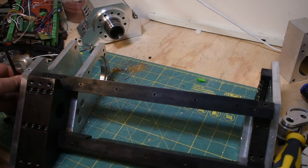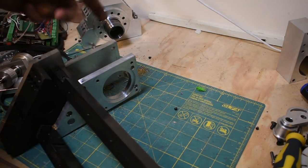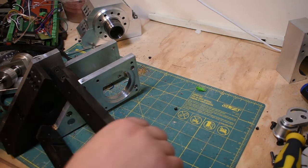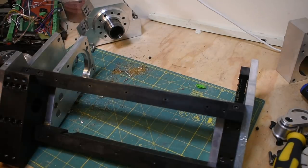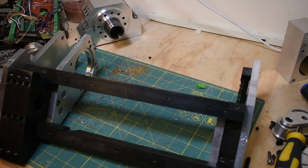So I don't think this design is hopeless. Certainly having the motor mounted back here does lend itself to having some kind of a gearbox, or at least some kind of a way of adding a bit of extra support for the shaft to put up with the pulley tension. But certainly didn't work well for me, I don't think. A two-stage, one-to-one pulley system should probably be a warning flag. Like I said, gearbox, I'm hoping to have it automatically shifting. I think that's what most real machines do. They'll have a gearbox that lets the same motor that does 100 RPM also do 10,000 RPM.